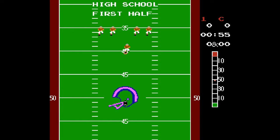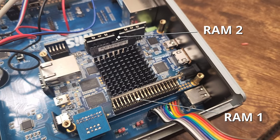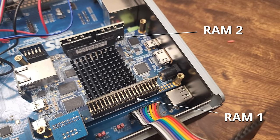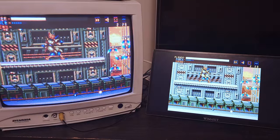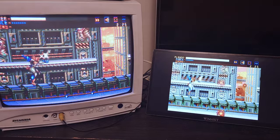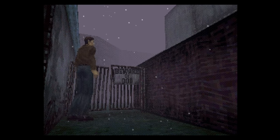There are two main reasons why you might want to use direct video over the analog I/O board. First, direct video allows you to use dual RAM, which can provide more memory bandwidth for games and systems that need it. The downside to dual RAM is that you lose the ability to output HDMI and analog video at the same time, a feature that's great for streaming and capturing video while playing a game. Another reason to use direct video is to get a 24-bit color signal, which is higher than the 18-bit signal produced by the analog I/O board.